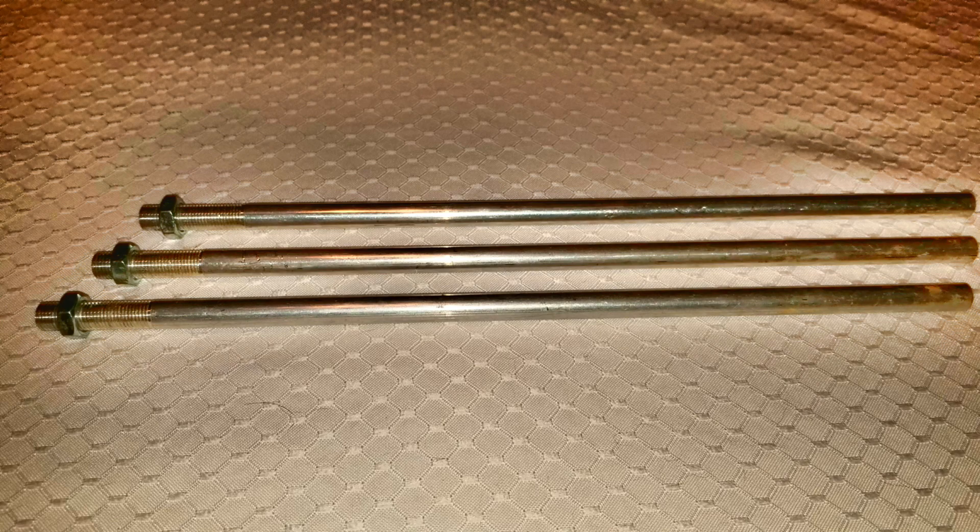To give a broader base, I'm also going to be working up a little weight system. It's like astronomy — whatever kind of tripod you use, you almost always want to have a weight on there to help dampen vibrations and keep it more stable. Even though this isn't a real big antenna, if it's windy that day you could potentially get enough wind load to knock it over. The bigger base with the 30-inch legs will help, but I'm going to try to come up with a simple little weight system, nothing real heavy, but enough right down there towards the bottom to help keep that from happening.